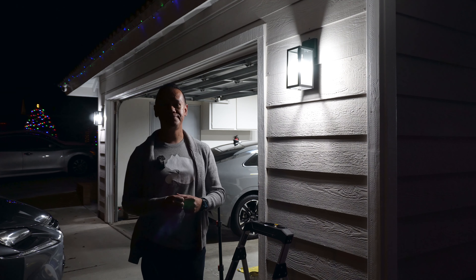The red cable from the photocell is going to be connected to the black cable coming from your light fixture. Now we only have three cables left: the white one is going to be connected to the white cable coming from the wall, and the black one connected to the black cable coming from the wall.